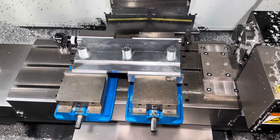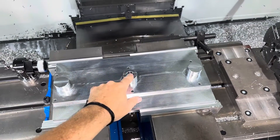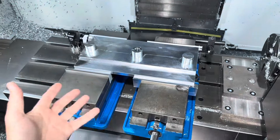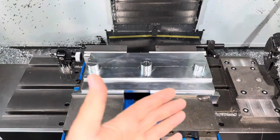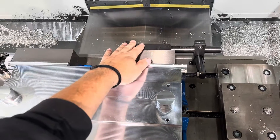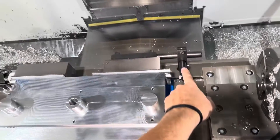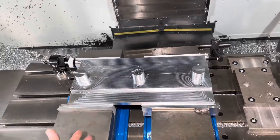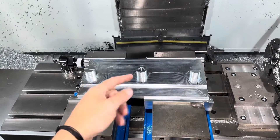Now that I know the OP2 fixture fits nicely, we can start setting up the second operation. Once the valve cover is bolted onto the fixture I won't be able to pick up my locating hole in the center, so I have to locate the fixture into the vices first, probe it, then put the fixture and valve cover back in and start machining. To ensure I locate the fixture in the same position after removing it for assembly, I use stops — physical devices bolted to the back of the vise that bump against the side of the fixture to relocate it precisely.